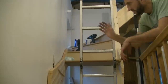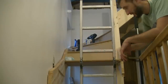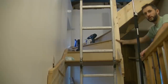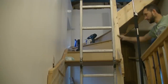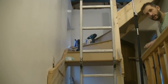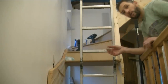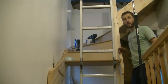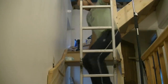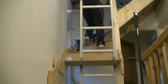What we've done now is secured the stringers into the wall with masonry screws — they'll be hidden underneath the stairs. We've done the same over there. We've got this post which is holding the stairs in place and adding structural support. All we've got left is another post here, then the winder and down to the ground. Hopefully by the end of tomorrow we'll get that sorted. And I'll show you now that you can actually walk up this staircase — well, half a staircase anyway.